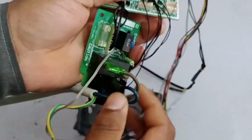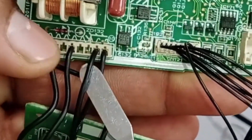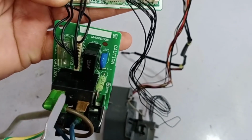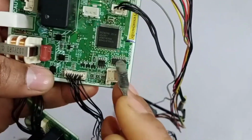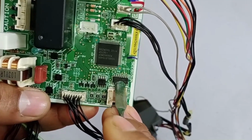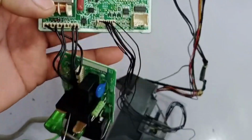Similarly, if we talk about the switching relay, it works in the same way. The 9th wire serves as the positive supply, which is directly connected to the switching relay. However, the negative point is not directly connected. To connect it, you can see that I have checked the wire and it is going inside the Darlington Array. This IC is similar to a ULN 2003 type IC. The negative point is switched on from here to activate the switching relay.